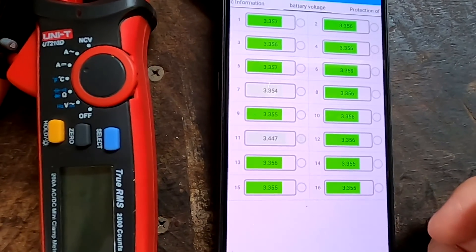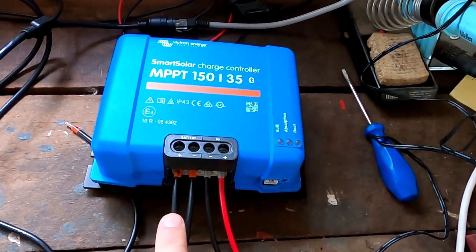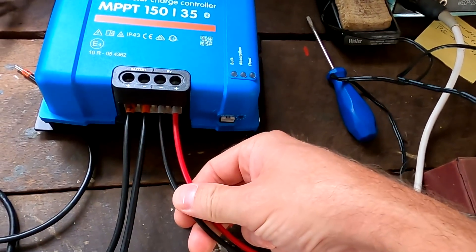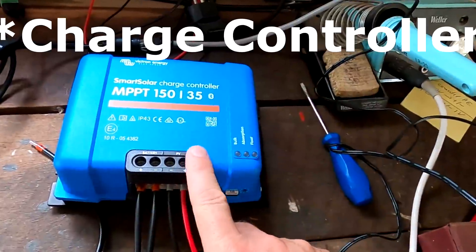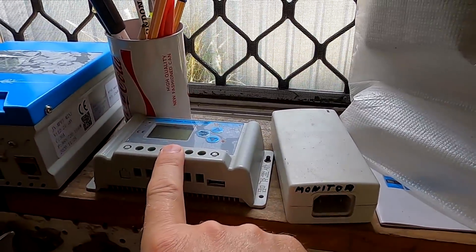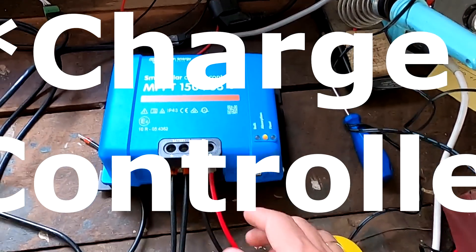The BMS has totally shut off now, so it's only the inverter and solar running. You can see the inverter does not go up in smoke even though the BMS has turned off the battery because of over voltage - the solar charge controller is not taking any harm from just being connected to the solar panels. Some inverters cannot do this - this one is fine, but one of my old PWM controllers for eleven dollars went up in smoke after half an hour because I disconnected the battery. This BMS turns off but the inverter stays on and controls your solar, just not charging.